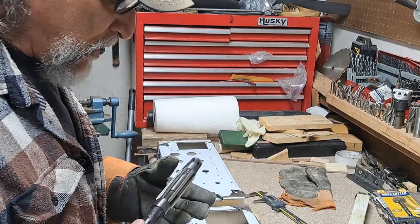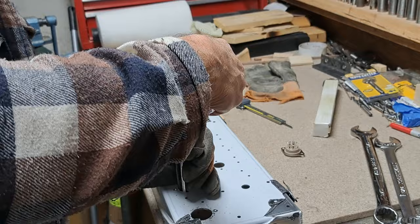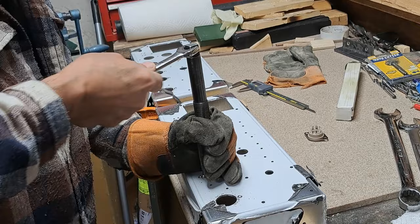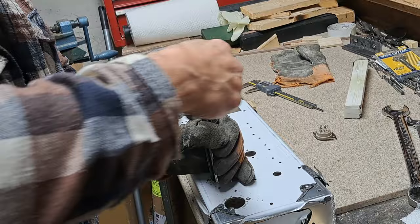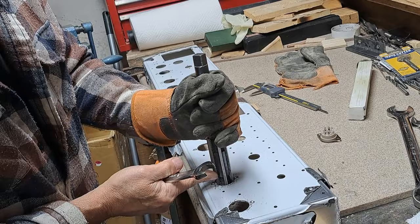I take it you're not going to be coming back in the house anytime soon. No. So say you're working on an old Tweed or something, right? And you're like, oh my God, I've got to change this tube socket and I can't find one that fits in there — cause they don't, they're all a little bigger now. What do you do? You've got an amp that's all wired and everything. Well, you can figure out a way to clamp it up somehow or do it with this in your lap, because it really only has to drop through a tiny amount. I'll show you how much — so hopefully you don't have to disassemble the entire thing. See, that's dropped through now. It really only has to drop through about that much clearance.